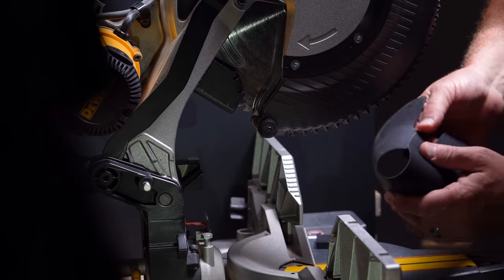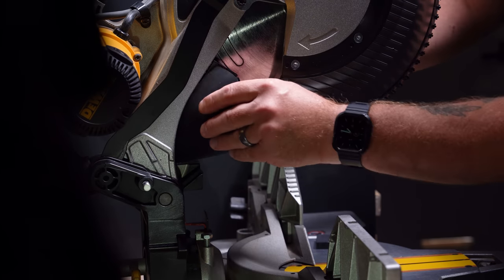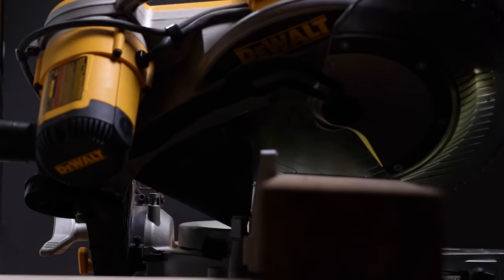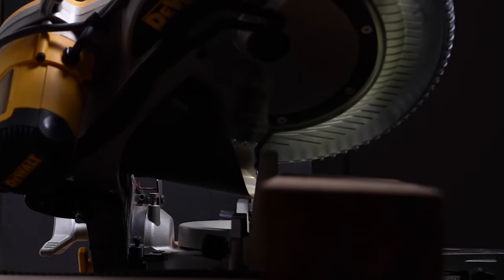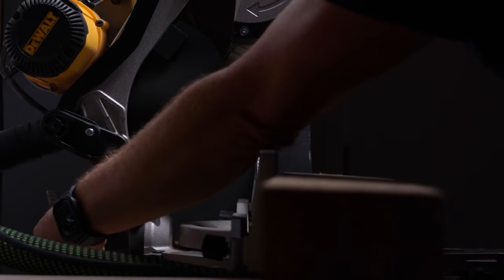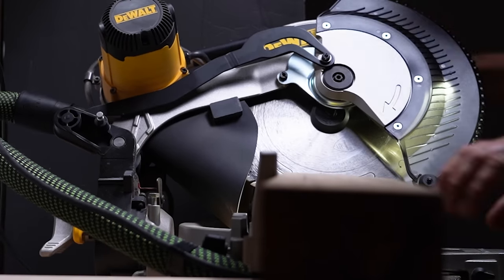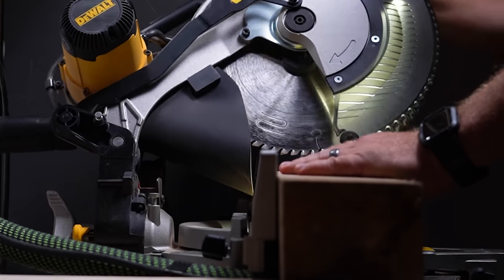This new design captures almost all the dust from that area and increases the amount of vacuum at the mouth. The biggest problem with every shop-made dust collection contraption I've seen is that you can only use them for certain cuts — usually 90-degree cuts — and that's fine if you're only making square cuts. But if you want to make a miter or bevel cut, you're going to have to trim and cut somewhere along the way, and just a heads up, that might come at an overall performance decrease.